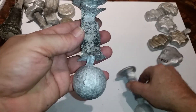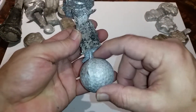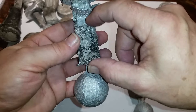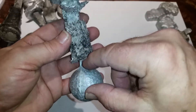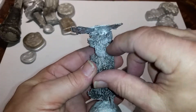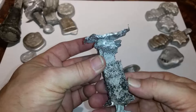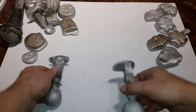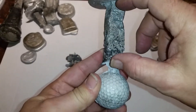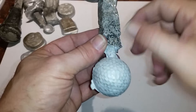But the end result, as you can see, as it collapsed into the mold in this one, it pulled in a cavity of air — or collapsed the aluminum — and that caused the collapse of the top surface of the bowl. This volume must have fallen in and pulled an air pocket in. And here's a larger cavity that's inside the sprue. This is all open at this point, so this should have cast. You've got to keep pouring even though it looks like it stopped. In this case, that cavity when it sunk in — here's the cavity in the middle of the sprue — that's what would have sucked in as this cavity fell in.